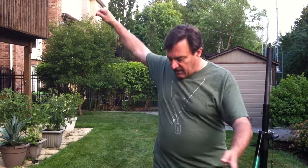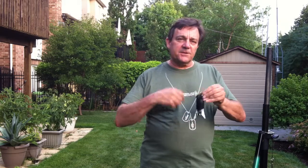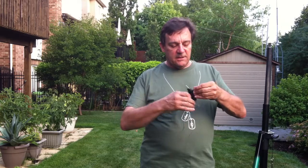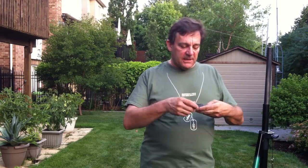So I'm going to unravel this. You want to read the manual right off the bat, because when I unpacked my antenna and tried it out, the SWR was way too high. I realized after measuring that they give you extra antenna wire so you can tune it as needed. The actual length for 20 meters for an EFHW half-wave antenna is 31 feet and 3 inches. As you can see, it's got a built-in winding area with the balun included, and the ability to add a counterpoise if you wish.